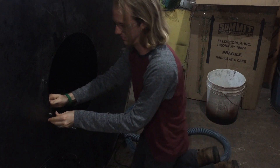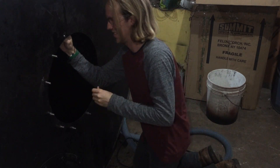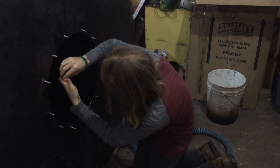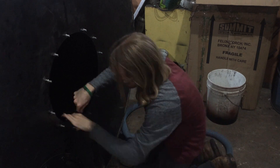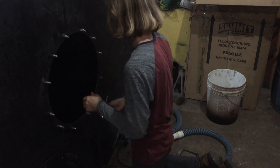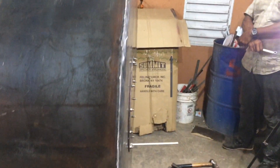Right here I'm slipping in the stainless steel bolts into the holes that I drilled before, using the lid as a template. They get welded from the back side so gas can't leak through the bolts, and we tighten the nuts just to keep them straight. Don't over-tighten them — if the bolt gets too hot during welding, the threads can distort, you can't get the nut off, and the bolt can break. The silicone I'm using to seal it is a urethane silicone used for automotive applications, like sealing windshields and lights. Put on a good thick layer before tightening the bolts and it seals up any air gaps nicely.